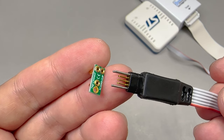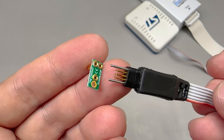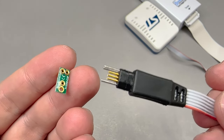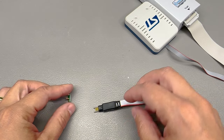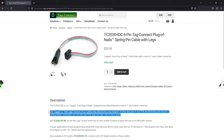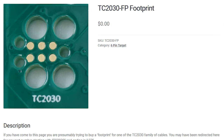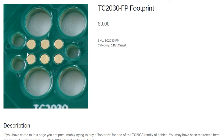They also offer small locking-type connectors that you can add to the back side of your PCB to lock the connector in place, which is useful if you're doing longer-term programming and debugging like I do on my workbench — I keep it locked in place over several weeks of development. There is also a slightly different version of the Tag Connect which has plastic clips built in; it requires a different footprint with holes where the plastic hooks can grab, and it uses slightly more board space.